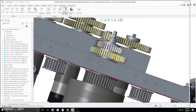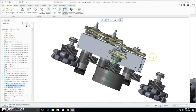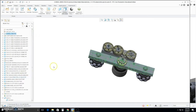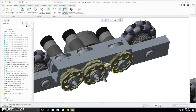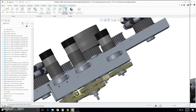Once this comes down to the bottom, it's directly driven into the wheels with a hex shaft inside of the tube. It then is belted from the center wheel to the external wheels on the outside corners. These are the gears used for the winch in the full assembly. And this rear gear is separate, it just connects to the sweeper.